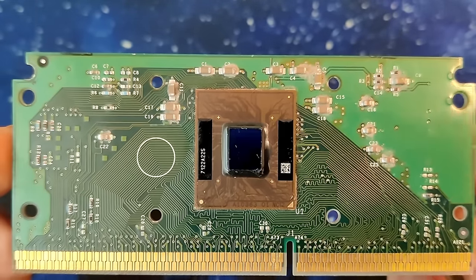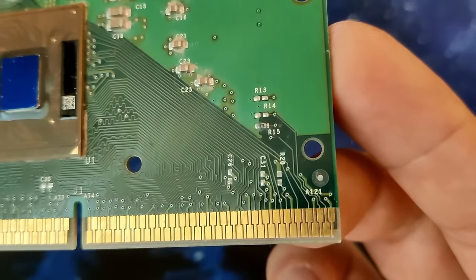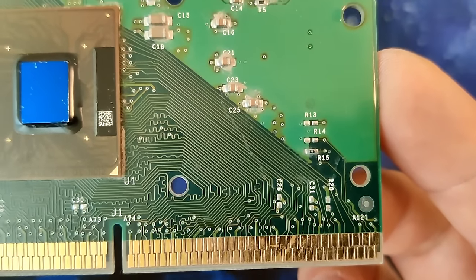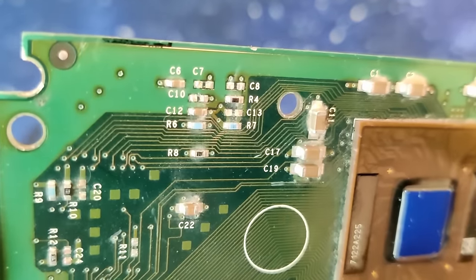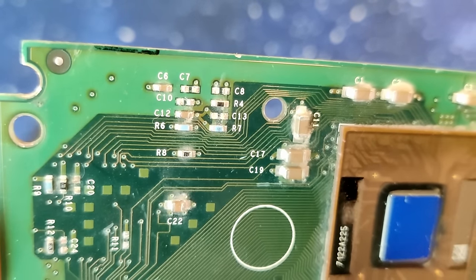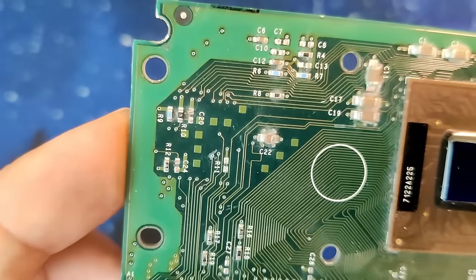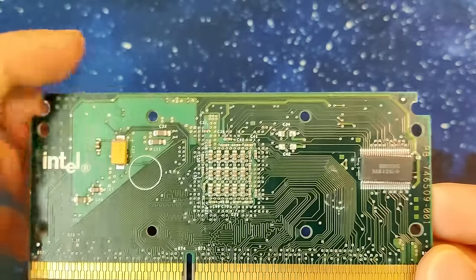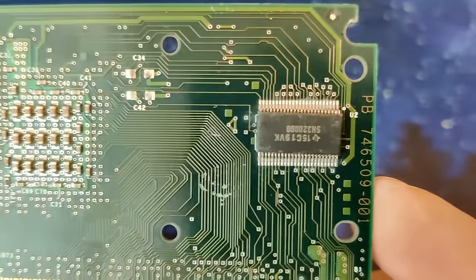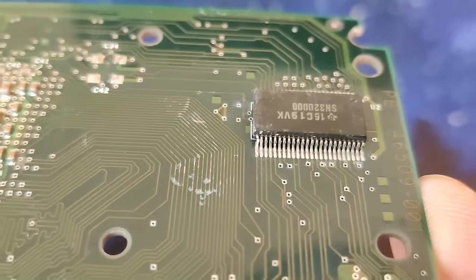You can tell from the looks of this CPU it had a tough time at the scrapyard. The silicon die is scratched, with small pieces chipped off from the corners and edges. It doesn't look severe however — the core may still be functioning. We also can see a lot of missing SMD components, mainly capacitors and resistors. When we turn the cartridge around, damage traces catch the eye. I am sure some of them are severed, but we will confirm that very soon under the microscope.